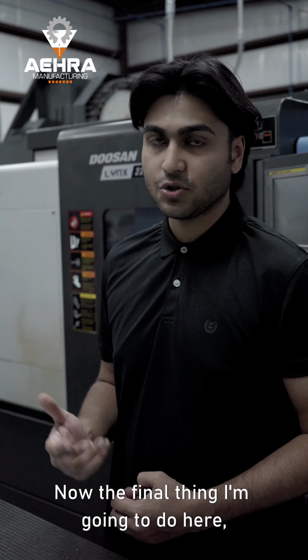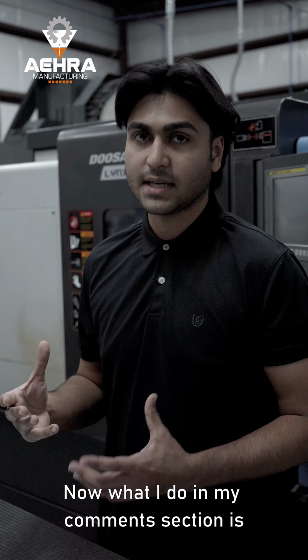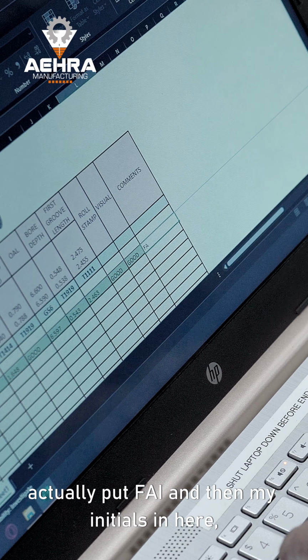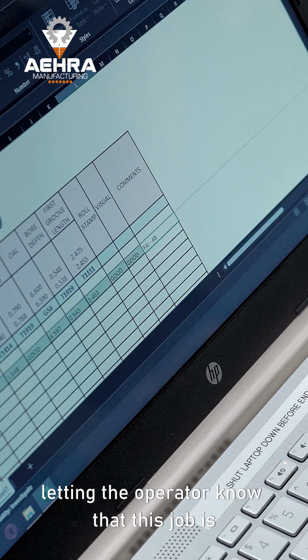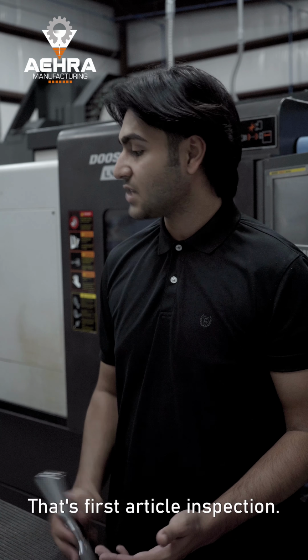Now the final thing I'm going to do here, I have a column that says comments in it. Now what I do in my comments section is I actually put FAI and then my initials in here, letting the operator know that this job is ready for production. And that's it. That's first article inspection.